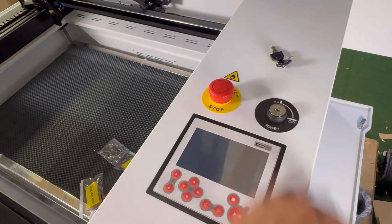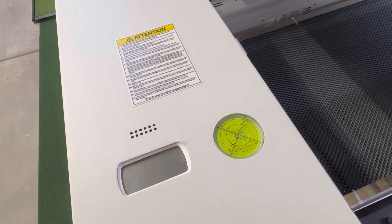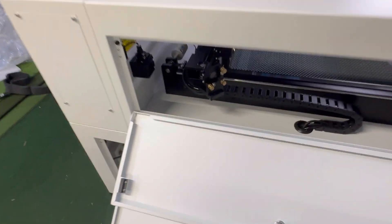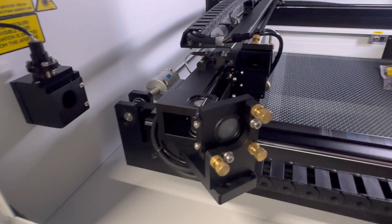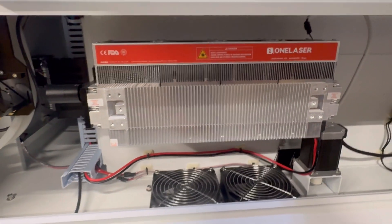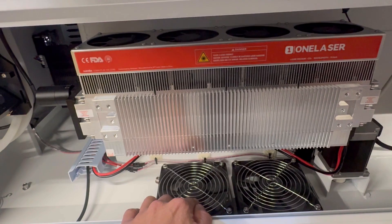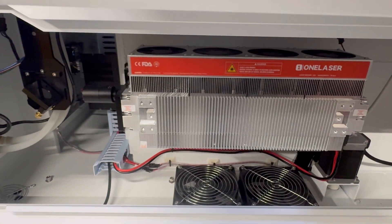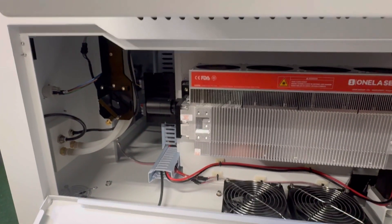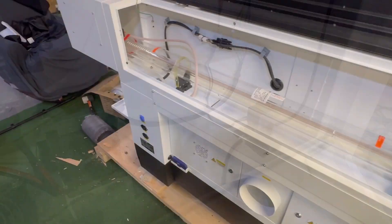On the control panel you have the Ruida controller, an emergency stop, and an on/off key switch. Going to the other side, you have a level — my daughter came out and asked why it has a compass, but it's actually a level — and an air quality tester. On the left side of the machine, the beam comes through the wall hitting your mirrors and laser head on all the nice rails. Below that on the left-hand side is your 38-watt RF tube, which is air-cooled. It hits a mirror and goes up to meet the other mirrors to direct onto your material. There's also an air solenoid so you can hook up your compressor, already built into the machine.